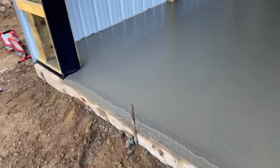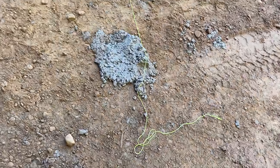Okay guys, we are gonna dig these doorways out. First thing you wanna do is take a string line, just a dry string line, and put it against here and over there and just pick it up and thunk. See how it leaves a line there, and we made up a little board. So we did both doorways, obviously.